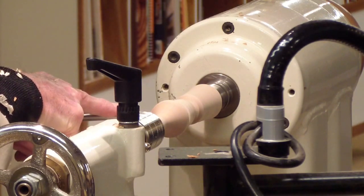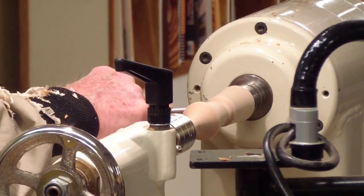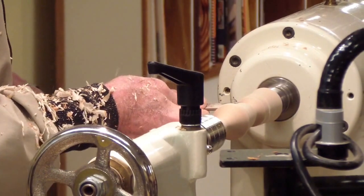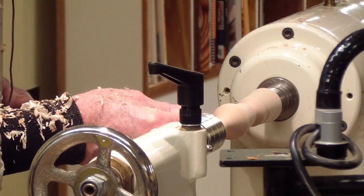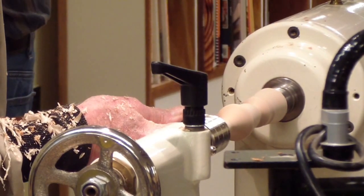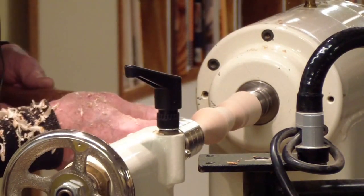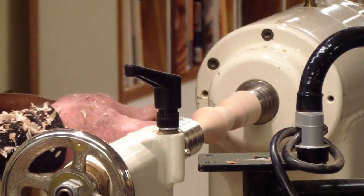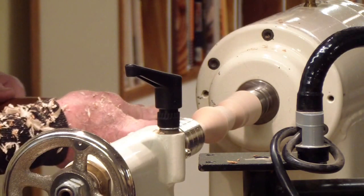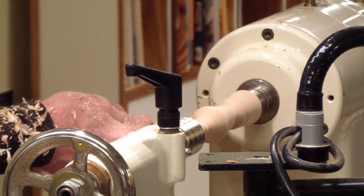This hand holds the tool down, and this hand does the turn. If you start pushing with the other hand, you'll get mixed cuts and all kinds of stuff. To start to cut, go straight in, turn the tool straight up and down, get your mark, and open the tool up just a little bit. And then slide your side. Anyway, you do all kinds of details on these things. Want a ball on the end?